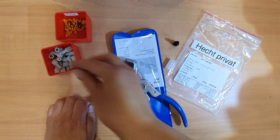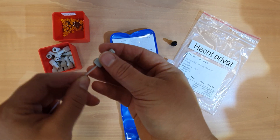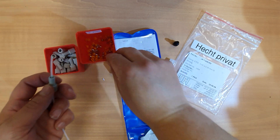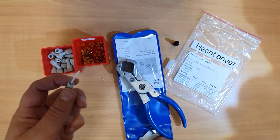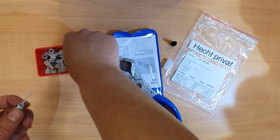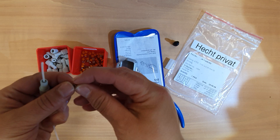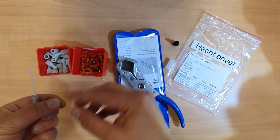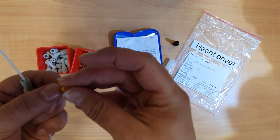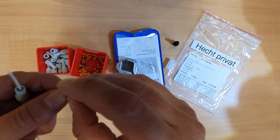Then you're going to add the nut to the tubing. These are two-piece fittings. They're nice because you can tighten them without twisting too much on the tubing, and in my experience they give you a really nice tight fit. There are two pieces: a stainless steel ring and then a second ETFE piece which will sit against the fitting.